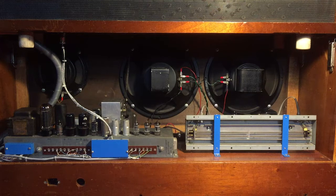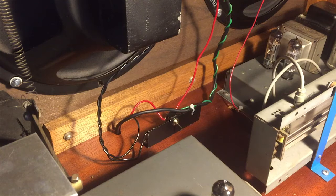Also, working with those types of amplifiers, tubes are quite dangerous — not just because they get very hot, but because of the voltage they actually run. They run at very high voltages. If you take out the tube, switch it on, and stick your hand on the connector, you're going to end up having a very, very bad day.